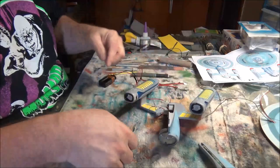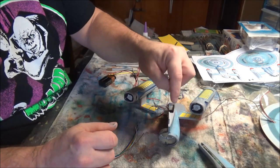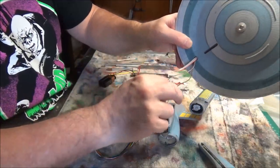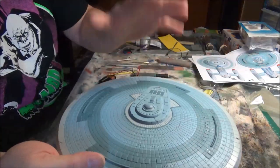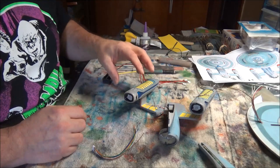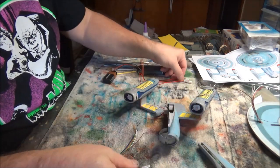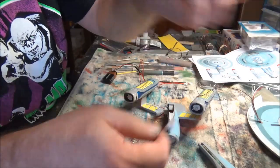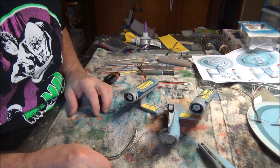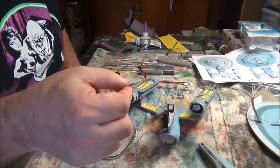But that only gets us two-thirds of the way there, because once this is all together I won't be able to join these wires to the wires that go up into the saucer. So what I need to do is make a modular plug that I can run up the neck and have the plug hanging out of the neck, with the corresponding receptacle plug on the saucer so I can plug them together and set it down. It would be nice if I had a single six-prong plug since I need six wires, but I don't. I do have a series of two-prong plugs. I'm just going to gang up three of them, and I'll write down exactly what each wire does so I don't get lost - they're all identical.